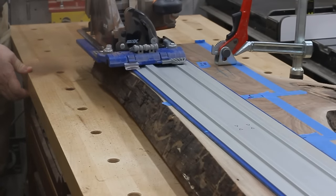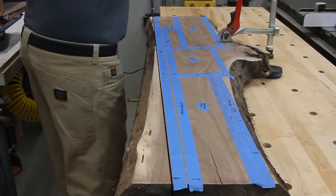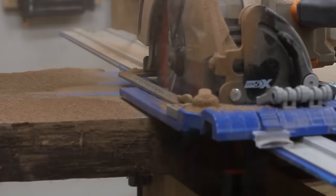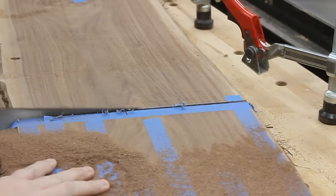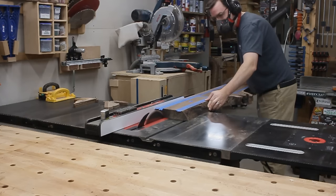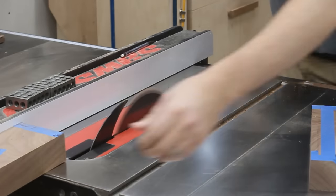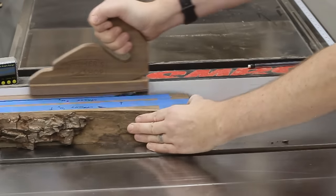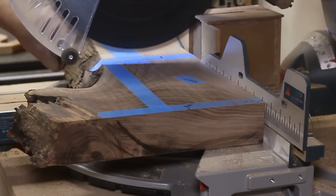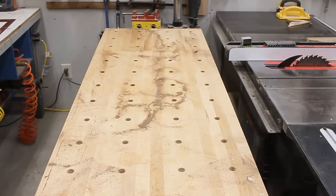Next was getting them cut out. I used my track saw to rip a straight edge down one of the pieces. One issue I had was that the saw didn't plunge deep enough to get all the way through the slab, so I had to go back and finish it up with a pull saw. Then I cross-cut the slab to finish cutting out what will be the top of the bench. I moved on to the table saw for more cuts — this was a big two-inch thick piece of hardwood, but with a sharp blade and the right feed rate, my saw had no issues. Next stop was the miter saw to cut some pieces to length, and then I had the slab broken down with all pieces rough cut to size.